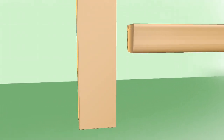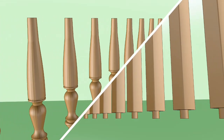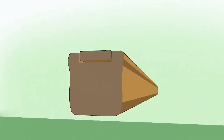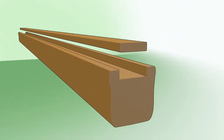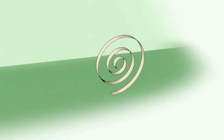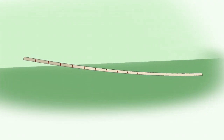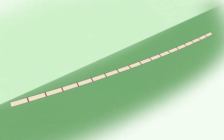The newel posts have flat sides, so it makes it easy to attach the rails and the bed frame. We pick balusters that have round tops and round bottoms. Be sure to pick a bottom rail that has a fillet, a thin removable strip of wood that you'll use as a template for making holes. Before you start building, take a length of elastic tape and make marks along it every two or three inches. You'll use this to mark the spacing for the balusters later.